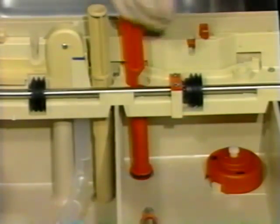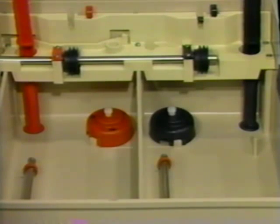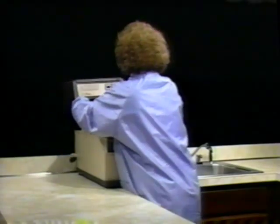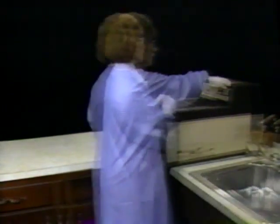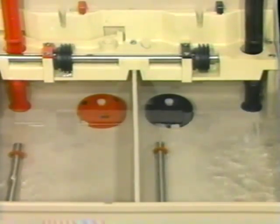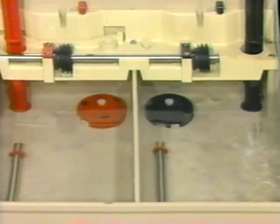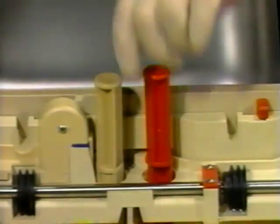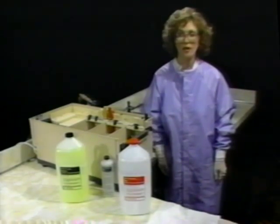Replace the drain tubes. The next step is to flush out the chemistry agitators at the bottom of the developer and fixer tanks. First, fill the developer and fixer tanks with water. Reassemble the cover and power cables and turn on the water. Then press manual start — the cycle is activated without the replenisher pumps adding chemistry to the tanks. After two minutes, turn off the power, remove the drain tubes, and drain the tanks. Thoroughly wipe each tank dry with a separate clean paper towel or sponge.